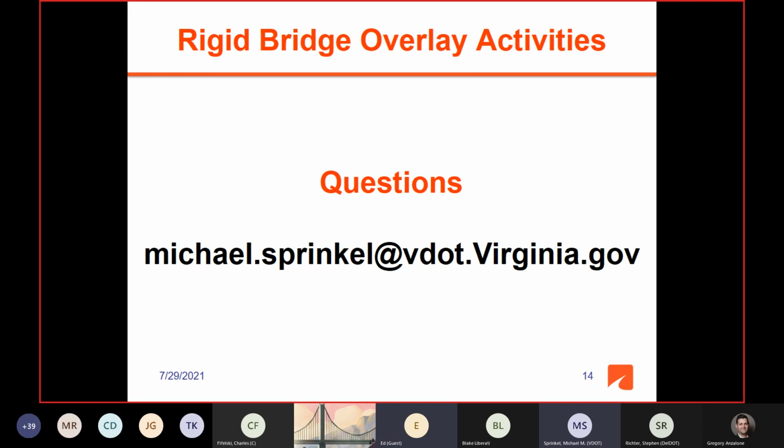I'd like to add, we did all the hydro prep and removal of existing latex overlays on I-95 there in Wilmington, and those old overlays really protected that bridge well. That's some nice proof, some nice actual long-term. I think those have achieved 30 years of service life, maybe, there in Wilmington, and now you're replacing them with the Class D and the second generation. And 30 years from now, you'll be able to tell.